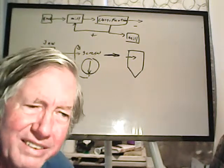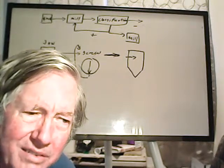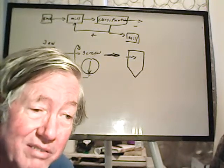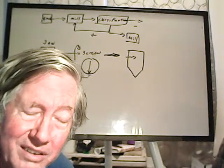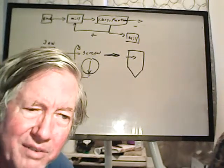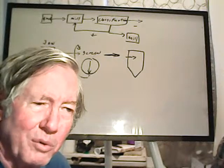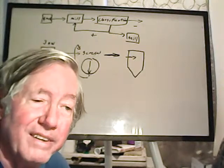It's got to be fairly small. And say cast iron might work, but I don't know. That's going to have a little problem when you're real close to bare wire heating elements, because if you touch those, now you're shorting them directly out. That wouldn't work. Yeah, some kind of refractory tile. That's what I'm thinking, Chris. If you see some, send me a link or whatever, because something about 1/4 inch thick I think would be ideal, especially if it's textured on one side so it would catch the drips. That would be ideal.